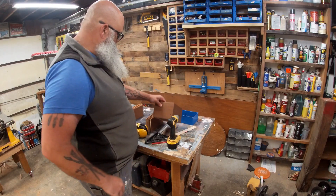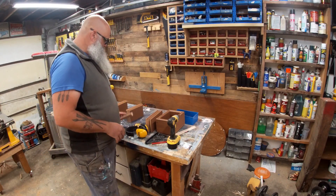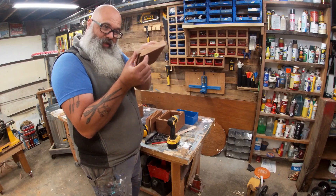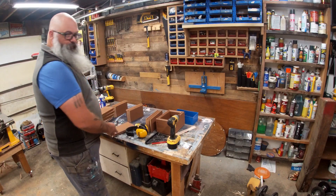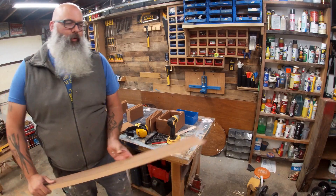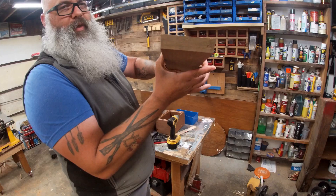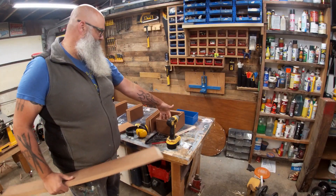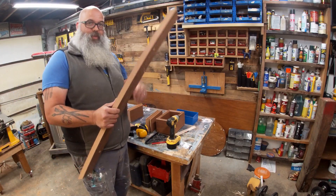I'm going to do the same for the short piece, but I'm going to make the short pieces the size of the inside. I went ahead and ripped one long board and went ahead and ripped both of the grooves off. That's four and five-eighths, so I'm going to make the short piece inside four and five-eighths, so these can be the bottom.